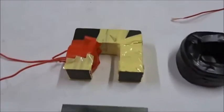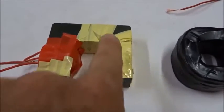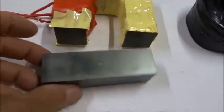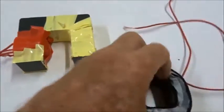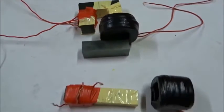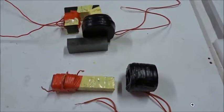The second transformer is this U or C-shaped coil, again covered with mylar tape for insulation. We've gone down to three plus three turns for zero volt switching connections on the ends and the center, and we're going to put another ferrite bar over it to make a closed circular shape. This two thousand turn coil will just go over one of the bars, and then we'll close the circular shape. Today we want to study the properties of these two transformers and learn the physics by which they behave.